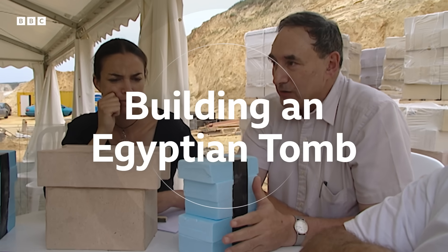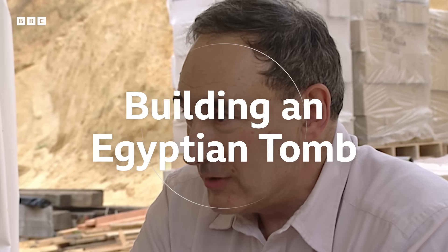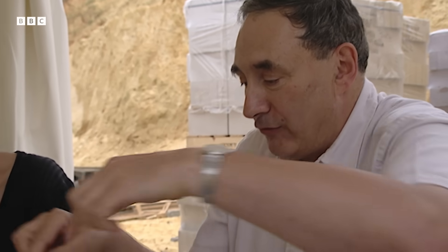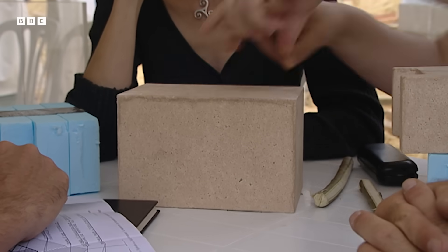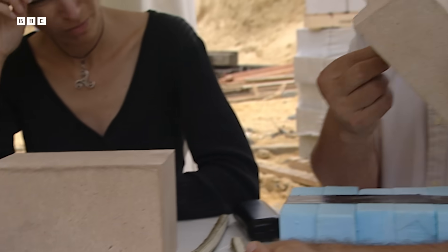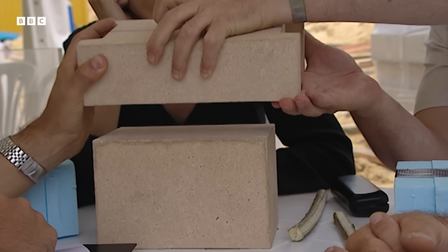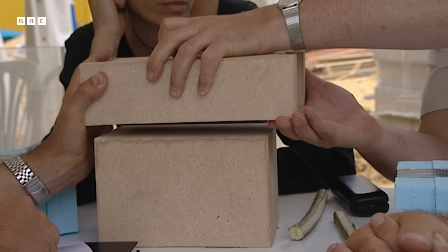I think the risks are very, very low, but the consequence of that risk is huge because we don't have lots of Egyptian slaves that we can damage. What I'm thinking would help reduce the risk considerably is if we drilled four holes down into the bottom of the sarcophagus, and had steel pins sticking out from here that coordinated with those holes. The pins would not actually touch the sides of the holes unless the lid started to tilt, so that it would always control the movement of that.